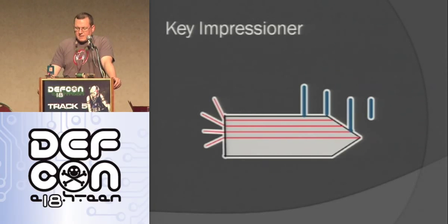That's basically how this key impressioner works. I stick this piece of plastic in — the red wires at the angled tip are all exposed. The blue things are the tumblers. As you pull the key impressioner out, at the right places it will hit just one exposed wire and you'll know, OK, this one goes down three-fourths of the way or something like that. So then you know what that key looks like as you pull it out. You connect power to the body of the lock and then connect all these wires off the back of this to your Arduino, and you just see which one is giving a high signal on a digital read — that's the one that's actually hitting because the body is providing power.